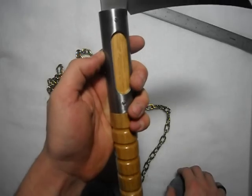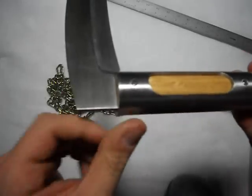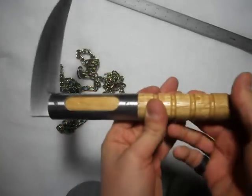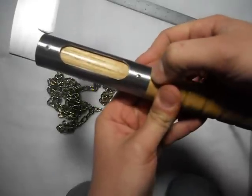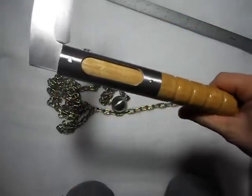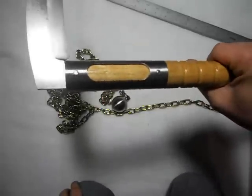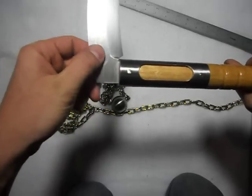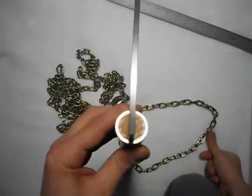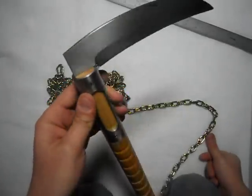And it looks good too. The blade is pinned — you can see there and there — the blade goes about an eighth inch just above the steel locking collar, going all the way through. This is glued and pinned; I use the glue just to hold it so it doesn't wiggle around while I'm drilling.